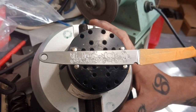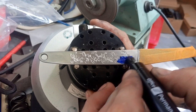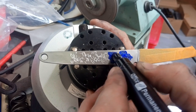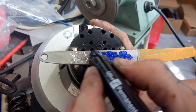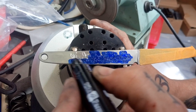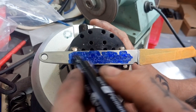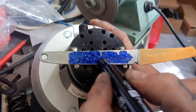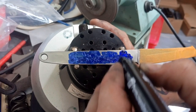Now after the attempt of engraving this pattern, I'm just gonna fill it up with some waterproof or permanent ink and then we're gonna sand the surface with a 400-grit sandpaper to get rid of all the burrs that came up from engraving. It also makes the pattern way more beautiful because the lines get way more crisp and it just looks overall better when surface finished.